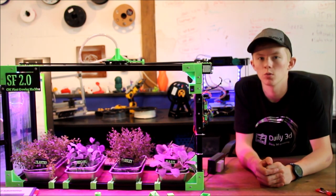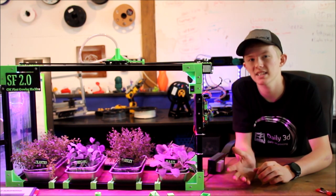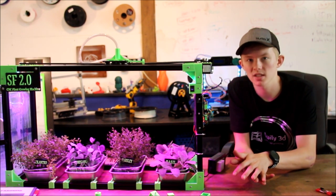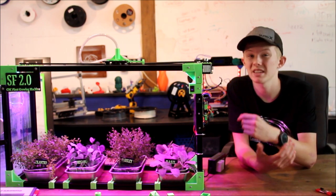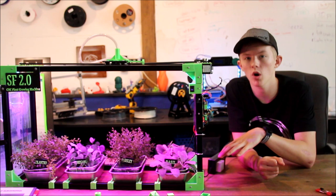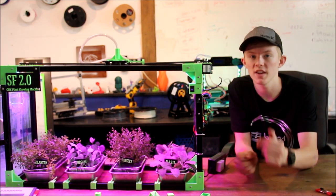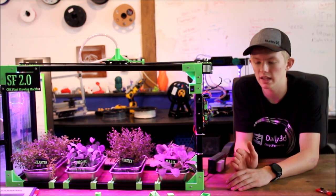Some of the hard parts with the code were learning how to use the RTC module and use that to trigger an event with the relay. I also had problems with that and the plant's code being mixed into one, because I put a big delay on the plant code so it wasn't always running, but then that delay would also delay the RTC. So if the plant would get watered and it would delay for an hour, and in that hour it was 8 o'clock, the lights wouldn't turn off because the code was still being delayed.